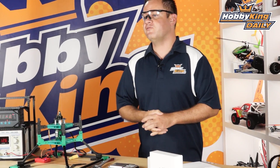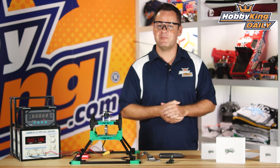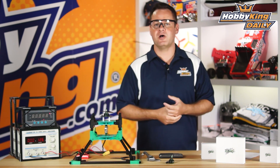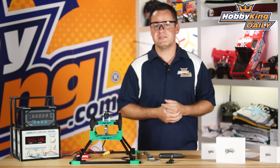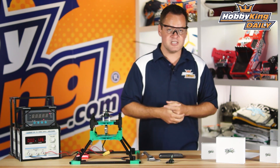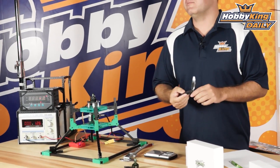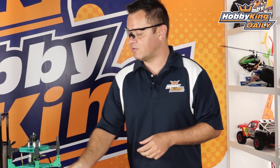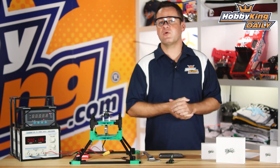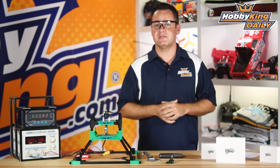That's extremely efficient for five-inch props spinning at high RPM. Obviously it's not going to be the same efficiency as a big 13-inch prop spinning slower, but in these smaller quads that's about as good as you can get. Max output is 361 watts with the three-blade prop pulling almost 400 grams at about 9.5 amps on this particular propeller. On the six-inch prop, I'd recommend that only for the two-cell application — that information is listed as well.